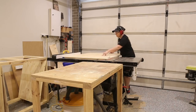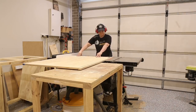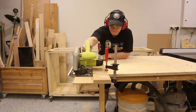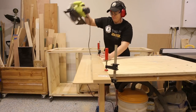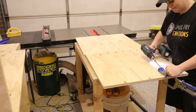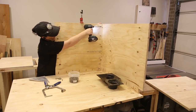The top of the bench is broken down into three sections: the miter saw station section, a sander section, and a drill press section. When it came to the miter box I had to take into account the depth of the saw and also the width, as I wanted to be able to cut miters so the box needed to have space for the saw to move. The miter saw box is constructed with pocket holes. I also notched out a little square at the back before construction for the power cord.